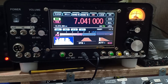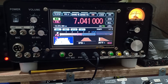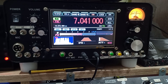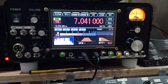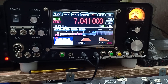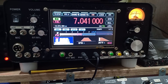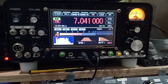This is the demo without the CMC — sorry, without the choke balun. The noise level on the 40 meters band is terrible. It's only during nighttime when the solar panels are off that I have no issue, but during daytime it's simply terrible. This is a long wire antenna without any choke. Give me two or three minutes — I'm going upstairs to put the choke balun in-line, and we'll see the difference.